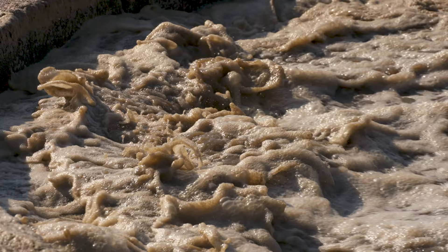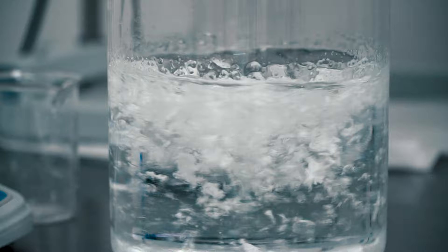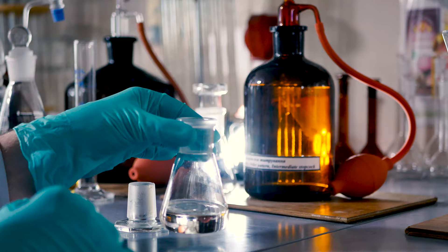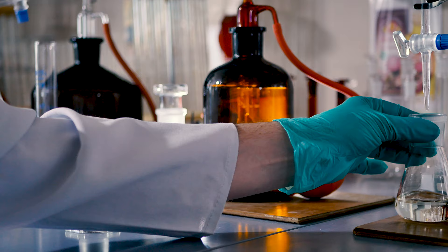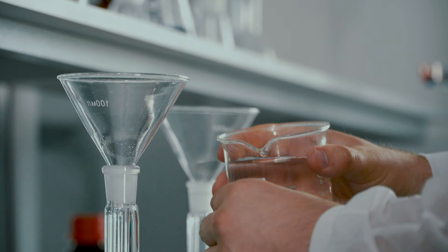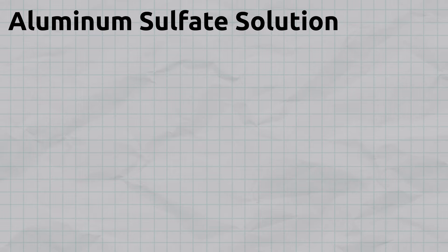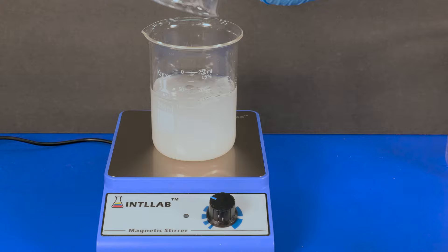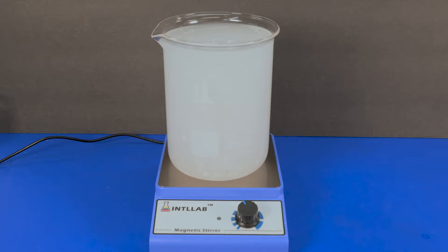So I started researching how wastewater treatment plants used aluminum sulfate in the process of cleaning water. Aluminum sulfate works by causing small particles to coagulate together for easy removal. The water treatment process involves far more than just adding a single chemical — how the water is mixed and for how long plays a big part in the process. So over the next couple of weeks, I spent time researching and testing different concentrations of aluminum sulfate in the resin wash to see what worked best for coagulating resin particles and removing them from my isopropyl alcohol. I was most successful using a process that added 25 grams of aluminum sulfate to 150 milliliters of distilled water. Water dissolves the aluminum sulfate into a solution that I then added to my resin wash. I then needed to mix the solution at a high speed for about 10 minutes and then a slower speed for 30 minutes.